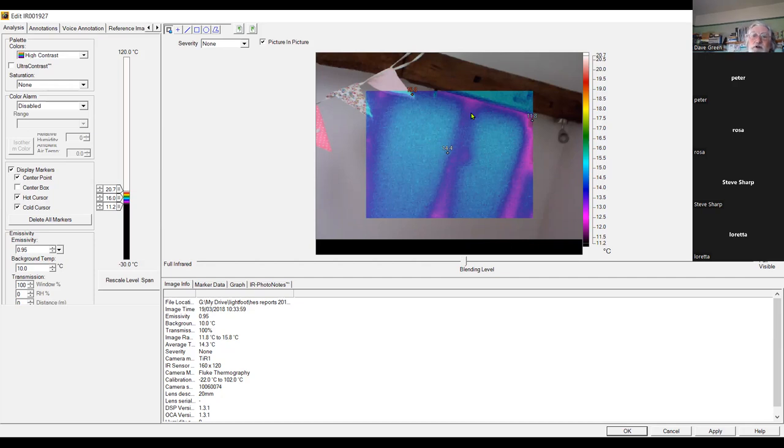But then when you get to the point where your ceiling is pretty well insulated, but there is this cold spot here, then it's tricky to know how much effort to put in to solve that cold spot. Like I say, that could then be a spot that gets mold and condensation. Obviously, if it's causing mold and condensation, then there's far more incentive to do something about it, to get rid of those cold spots.